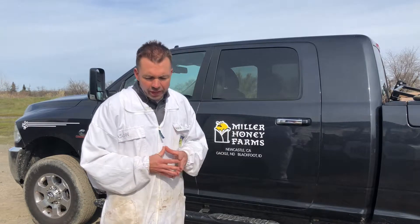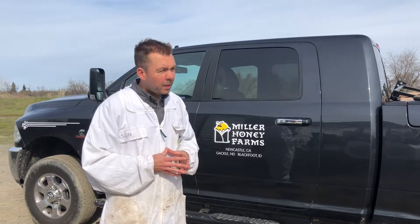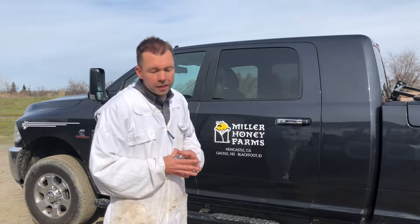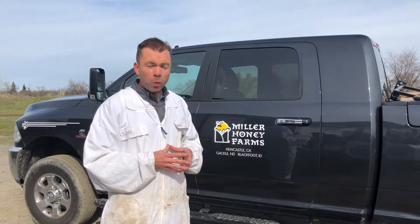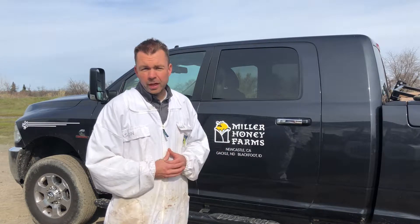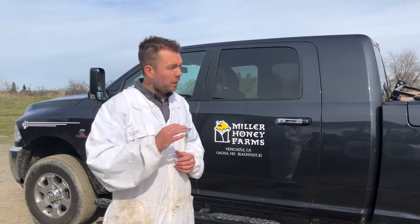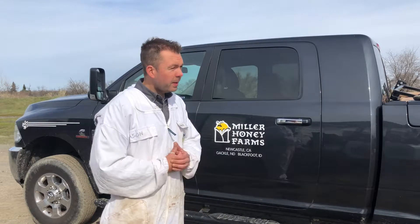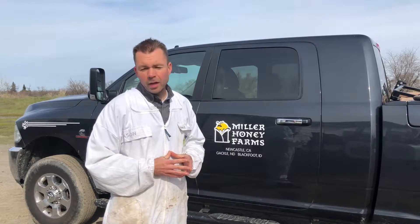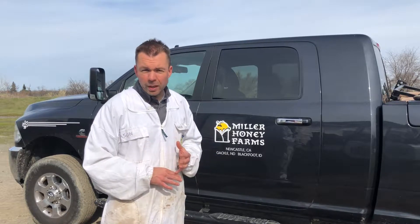Today I'm trying out version two of the pumps. I also tried out a Fillrite fuel pump — the 4200 series Fillrite, 20 gallons per minute, a high-flow 12-volt pump. It was phenomenal on the flow, just really good. It also had the suction to drop and mount right to the top of a tote. It was a really slick solution. The problem is they're not designed for a water-based material, and so inside is all cast metal that corrodes very quickly.